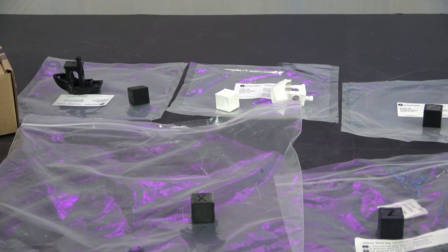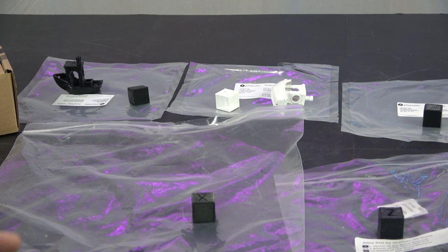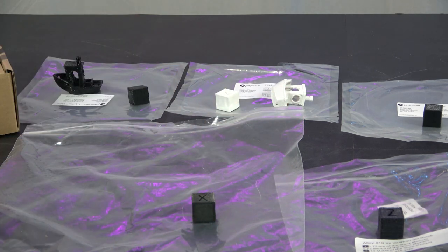All of these were printed with sample filaments — very short filament amounts — and sometimes it took a couple of goes just to get the filament to actually extrude. The settings were really particular. The biggest issue we had with any of these was getting the filament to stick to the bed. I don't think that's the fault of this particular carbon fibre bed — I think it's to do with some of these requiring special conditions like ABS slurries or specific adhesion compounds.